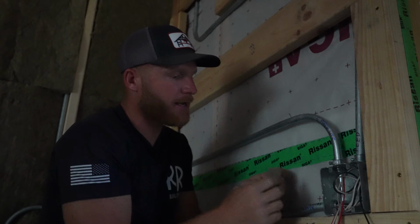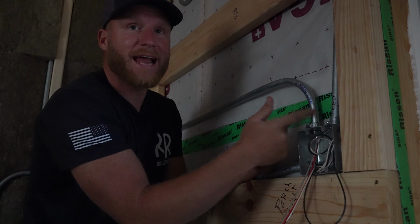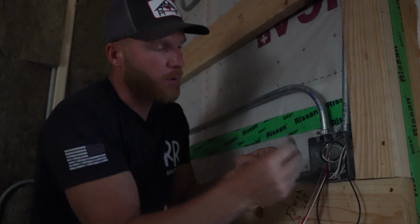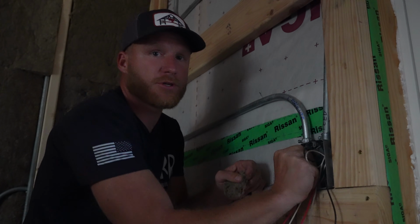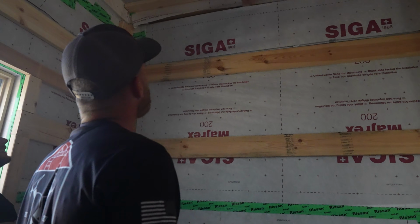Since Rockwool has great density, I guess it's so good that it doesn't allow air travel nearly as much as fiberglass or something. For the ease of in case somebody has to pull wires, these are the pipes that are going outside, and in case any air is trying to get sucked through, this Rockwool is gonna slow it down, but my client could still pull it out of there if he needed to push some wires through. Good, okay.